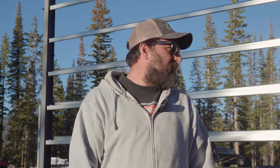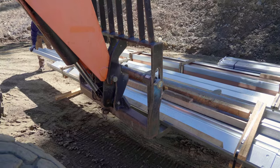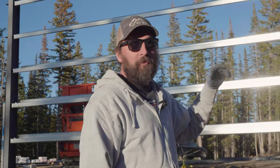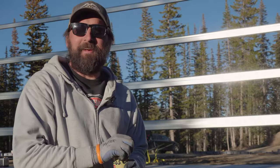We got all of our bolts set and all of the epoxy is in there curing — it's actually stiffening up a little bit. We got up here about 10 o'clock. We'll be starting tomorrow around 7:30 or so. Unloading the truck — that was a big truck. This isn't that big of a building, but because of the loads and the number of pieces it's really heavy — almost 40,000 pounds — so it took us a couple of hours to unload. We got right to work and were able to get the end wall columns pretty much stood up and one bay of girts on while wrapping up for the end of the day. It was a pretty good day — I'd say it's about beer time.